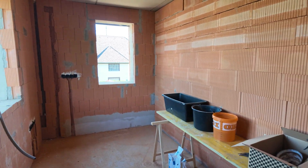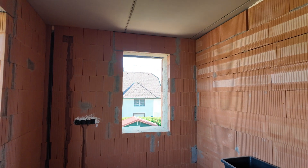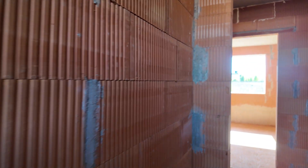Otherwise there will be an office — there are some more shades but everything else is basically the same. We have lighting circuits here, in this case just on/off 230 volt, then we have a push button for inside of the room and also for the outer hallway to leave the area.